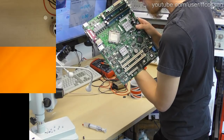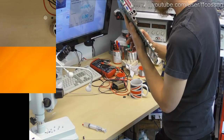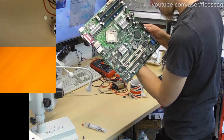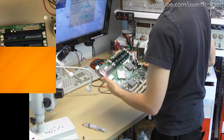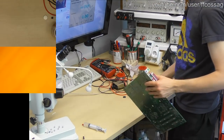We have Sanyo, Chemi-Con and Sanyo and Chemi-Con. And the SMD ones are unlabeled. And Chemi-Con and Rubicon. I don't see anything wrong with any of this. They used a KZG, which was a mistake they could not have predicted.